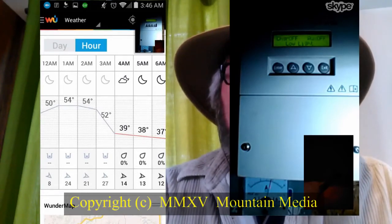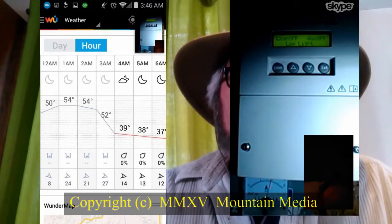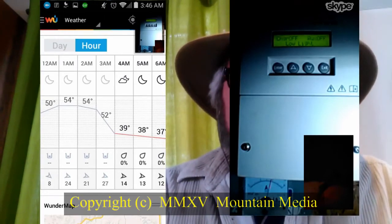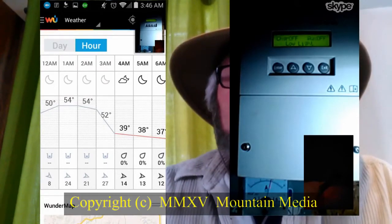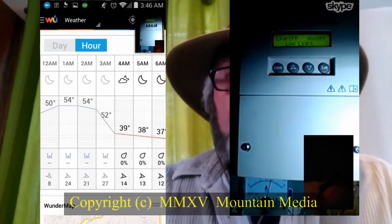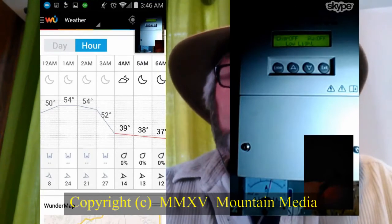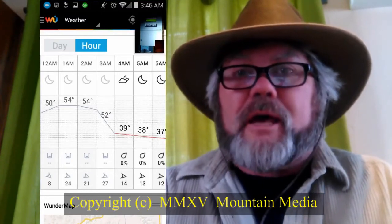In this photo, the output had actually peaked at 22 amps. But my reaction time, coupled with the delay on the Android, had the output back down to 18 amps before the screen snapshot was stored. The voltage that night was 55.2 volts, giving an output of 1214 watts that I personally witnessed. In all fairness, I have proof the turbine produced 993 watts — might as well be a thousand, because it's only seven away. Weather Underground showed the site near me had peak wind gusts of 27 miles per hour that same night.